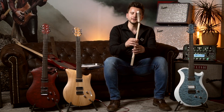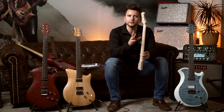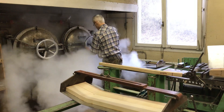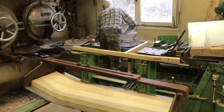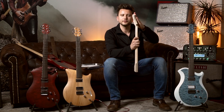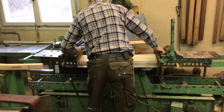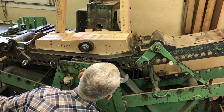The solution is that we bend over the neck, so this is before we do any CNC — we bend the neck, the maple. We steam it up, heat it up, and with a lot of steam and pressure we make the curve here, so we have this new shape and a new angle, and all the grains go through.